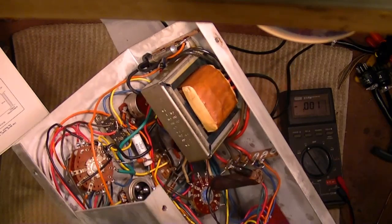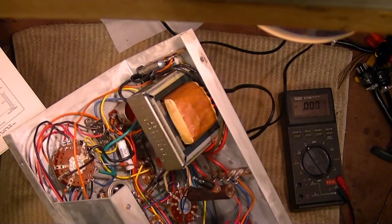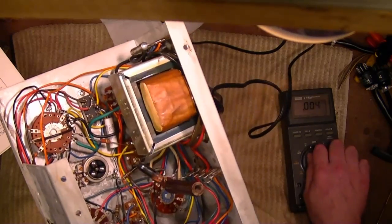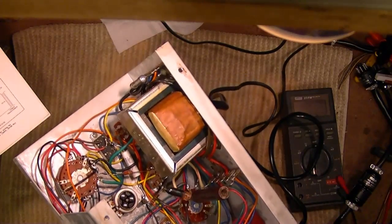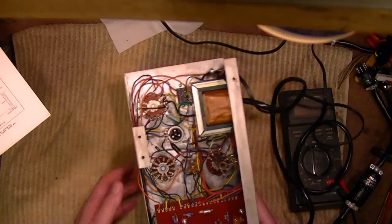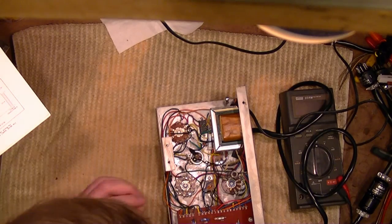something about they used a slight bit of radioactivity in some of these old ones, I think to make them work better or start conducting at lower voltages or something like that. Anyways, there may be a possible aging effect going on here that's affected the operation of this neon light bulb, and it's not doing what it's supposed to be doing, which is not just lighting up, but also regulating this voltage to probably about 90 volts, and not well over 100 like it seems to be. So let's check out this neon bulb a little more closely.